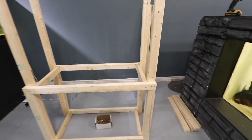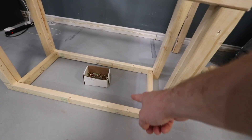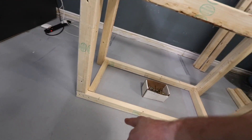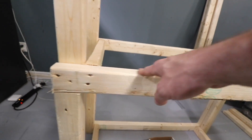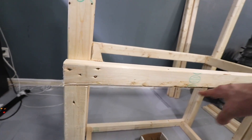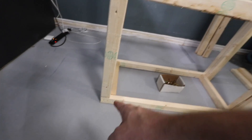Let me give you guys a better look at what's actually being supported. When the tank goes on this one, the floor is actually supporting it — the weight goes through the wood and transfers to the concrete. This is a 16-inch foundation, not going anywhere. When a tank is sitting on this one, all the weight is transferred to an actual upright — it's not put on the screws. It transfers through this entire length and the weight goes down to the bottom again. That's what we want.